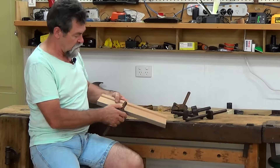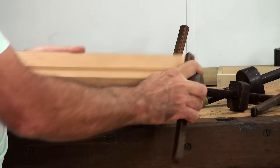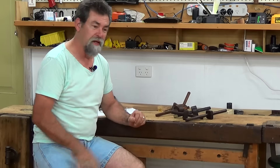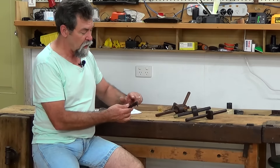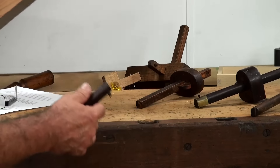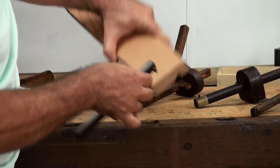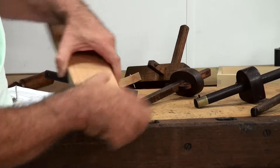I can use this as a reference point to create a parallel line along a piece of timber. And there's the line. Now why has he got different ones? The pointy ones are for along the grain, and he's got a few other ones here with knives instead of a point, therefore going across the grain. And they do a fine job of it — just a line run across with one of his gauges.